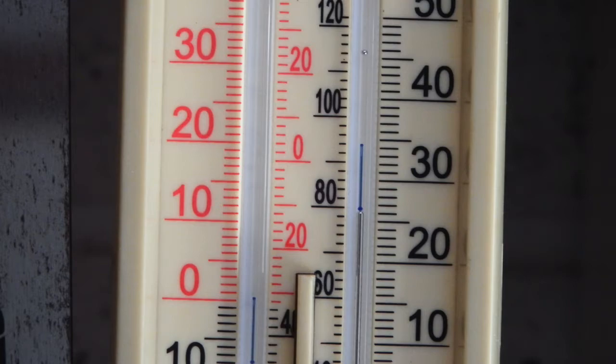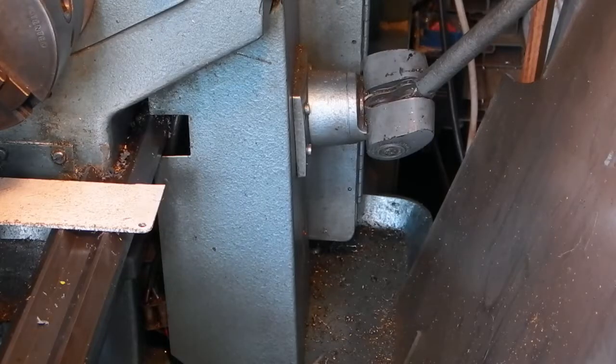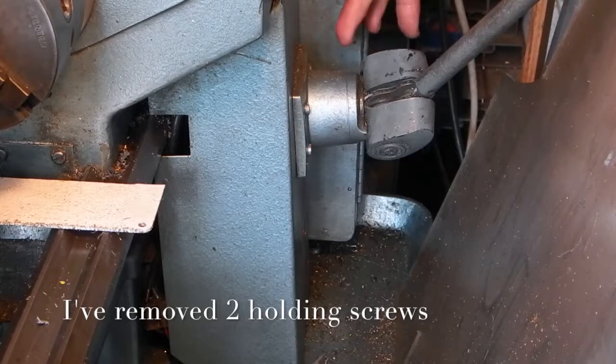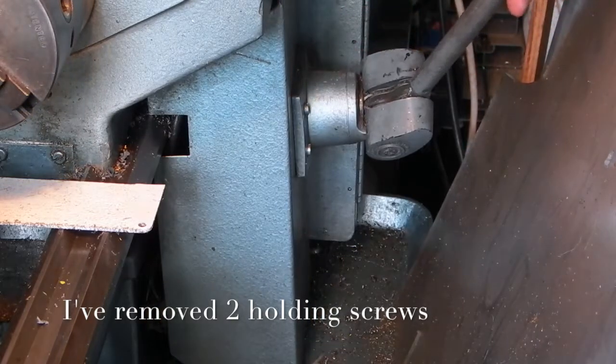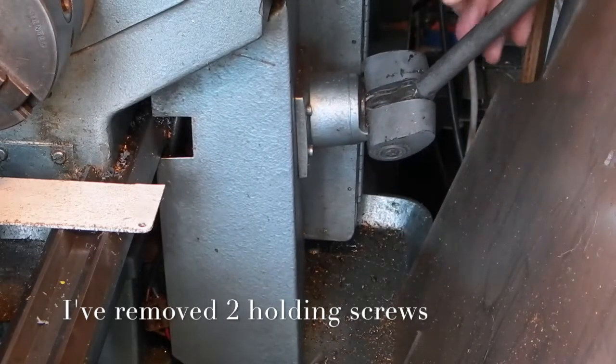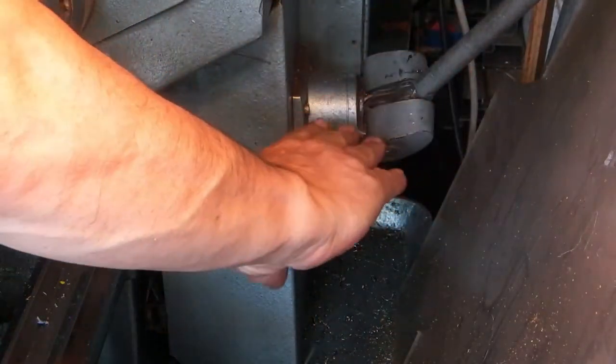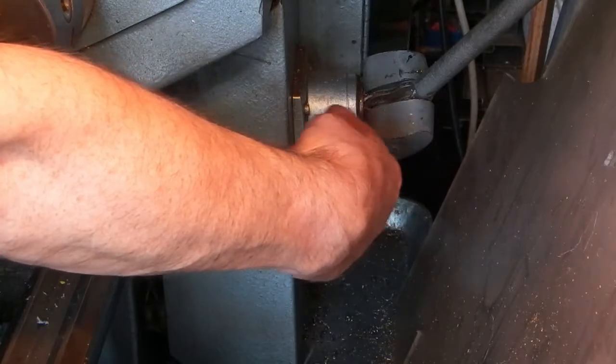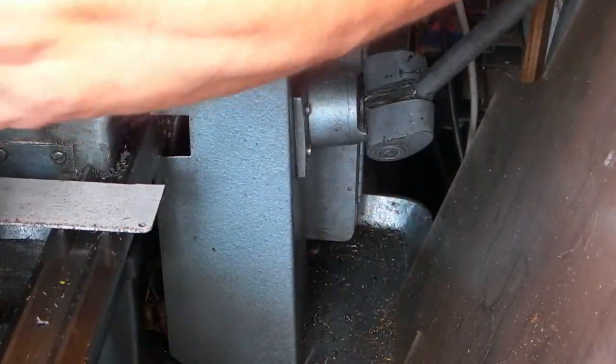It's 26 degrees in the workshop. Today I'm looking at doing some modifications to the lathe, one of them being a problem with the lamp. Ever since I've had the lathe the lamp has been fitted on this tin plate at the back. The problem with that is you lose one of your axes of movement — it's sticking out that way, you can only go up and down, you can't swivel the lamp around. So what I'm thinking of doing is putting some angle aluminium on here so that the lamp can stand upright and I can pivot the lamp around.